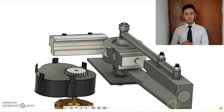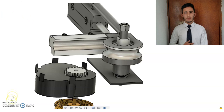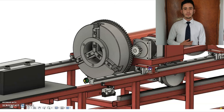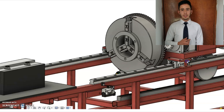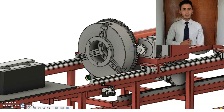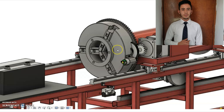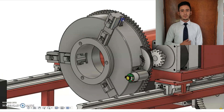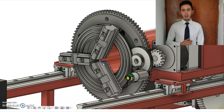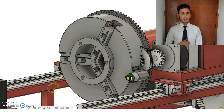This is slightly more than double the force needed to bend a 2-inch diameter mild steel rod. Finally, the drag and angle press: the press moves in two axes, providing the desired length and adjusting the angle before each bend. Movements are provided by NEMA 34 motors and, to automate the grip of the tube, we designed a chuck that fits a 12V motor and an encoder to detect the pressure exerted when we hold the tube.